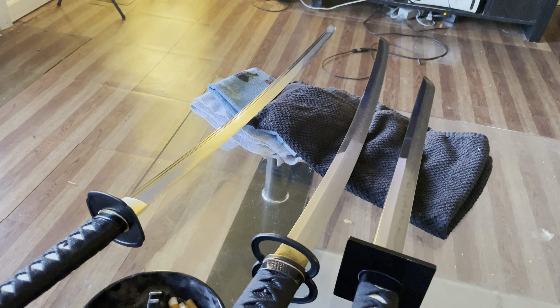1060 is a good through-hardened steel — Musashi does a decent differentially hardened 1060 option — but it will still chip on bamboo and roll on hard targets. Those swords are better for beginners, bottles, pool noodles, and display pieces. 1095 is where you really start getting into swords that can handle actual targets like mats and such. T10 is a tool steel and does very well beyond that.